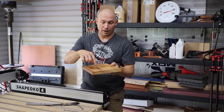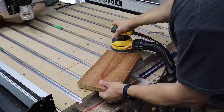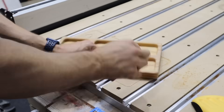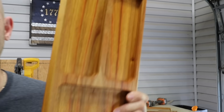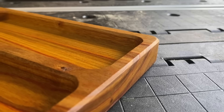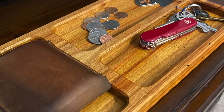So I'm just going to trim these tabs out and then take a chamfer bit — I think that will look better. We're going to chamfer these edges, sand it a little bit, put some Odie's on there. Look at that — first CNC project successful! Well, it was the third attempt, but the third attempt was successful. I'll drop a link in the description below to this file. All I did extra was put a little chamfer around the edges and it just kind of popped that detail out. This is a piece of canary wood — man, it's beautiful. Look at the wood grain. That's that Odie's oil making everything pop.